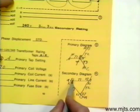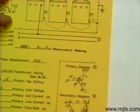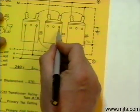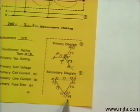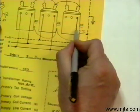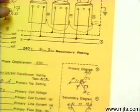Following our diagram for the low side connection: transformer one X1 goes to A, X3 goes to B. Transformer two X1 goes to B, X3 goes to our neutral or C. X1 on transformer three goes to the same place, X3 goes to our neutral, and then we come right back to A again. With that, we have our high side and low side connected.